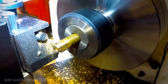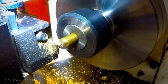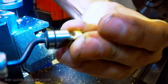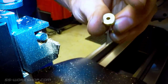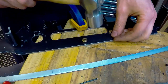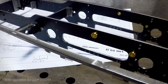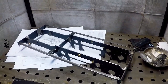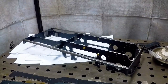Then it was time to finish parting the part off. I deburred the hole in the part using my Noga Protodrive countersink. Then the bushing could be tapped into place in its hole in the frame. At this point I decided to remake the frame with some additional material in the rear section and with many more tapped holes, to avoid having to have so many nuts inside the frame.